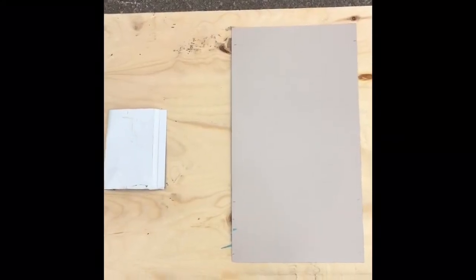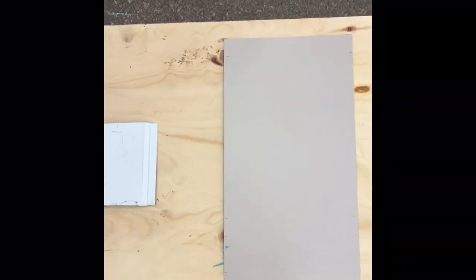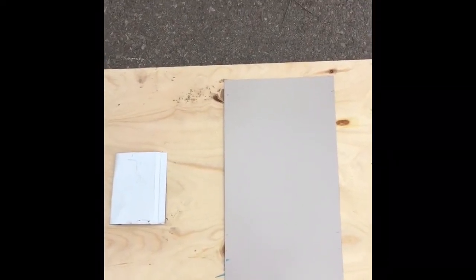So for any more complex bends, more than 2 bends I'm going to say, what I usually do is I'll do a template really quick. So here's my measurements that I need for this piece. And I just cut a little small chunk, marked it all out. So I'm going to bend this just to make sure my measurements are good. The building's a little bit wonky like most. So doing this I find saves a lot of time instead of bending a 7 or 10 foot piece. If something's a little off on this, I can adjust it, and then I go my full bends from there.